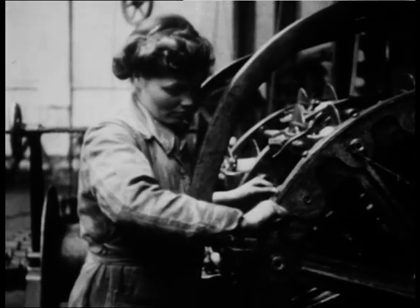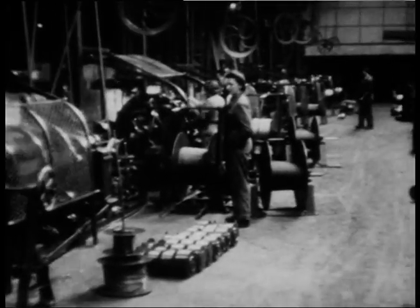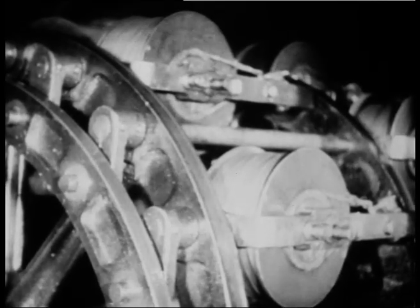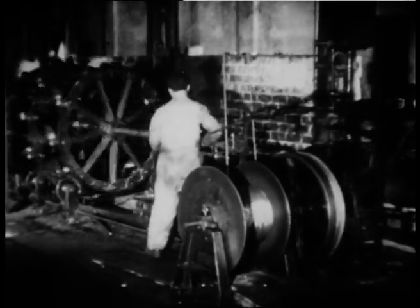In contrast, a sun and planet machine running in triple formation. These 18 bobbins revolve round their center like a planet round the sun. But each bobbin remains in a vertical plane. They carry 18 wires to manufacture a 37-wire strand, which they effect by covering a 19-wire strand. This gives a clear picture of the fundamentals of the sun and planet. It also has a headpiece with lay plate on the same principle as the snake machine.